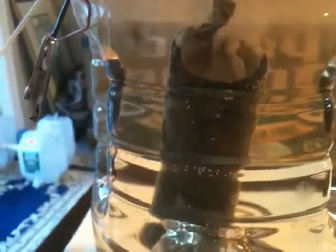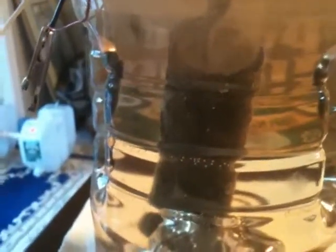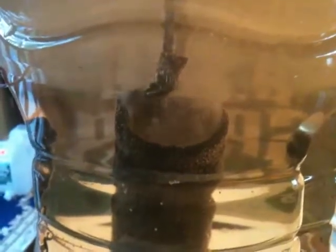And then this is the production that the cell is going through. This is a new cell. It's one and a quarter inch outside with one inch inside. The outer part has shrink wrap on it, and the inner part is filled with silicone, so there shouldn't be as much bleeding between the inner and outer walls of the cell. You can see the different production — that's up at about 5 amps right now. And you can kind of see it pulsing.